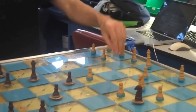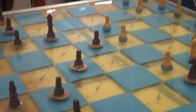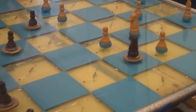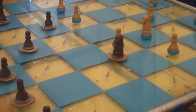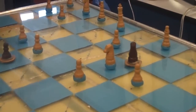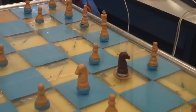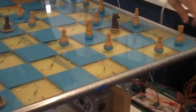We'll do some more movement to show you. This grid here basically acts as a huge keypad — it's 8 by 8, so it's 64 squares. Each reed switch has a diode, so we can detect multiple inputs at once, unlike a traditional keypad. That one set is 16 total lines.